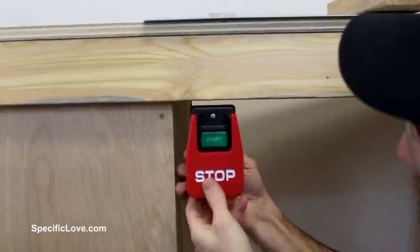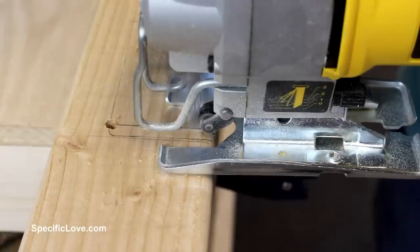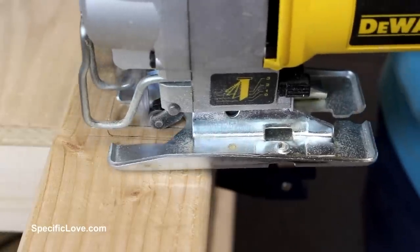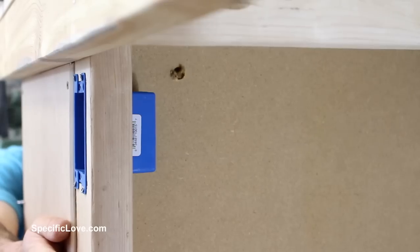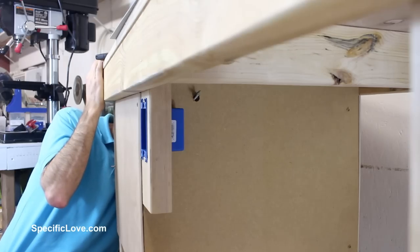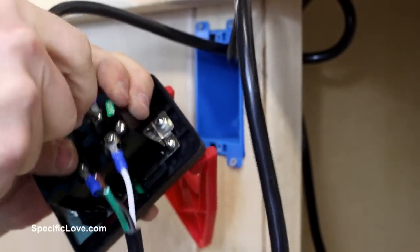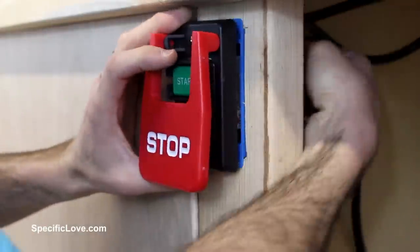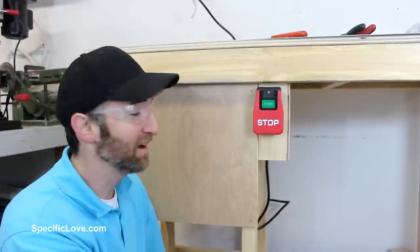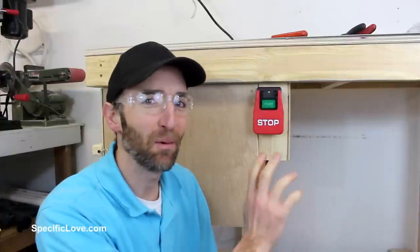Next up was adding a large safety switch to the table. This was an afterthought, so I needed to add a support board to hold the switch. I cut out a 2x4 to support a box and found a good location. I then cut a new extension cord and fed it through a hole I drilled up under the table. I carefully wired everything up and secured it in place. I am not an electrician so I was a little nervous for the first test — but here comes the moment of truth to see if I wired it correctly.